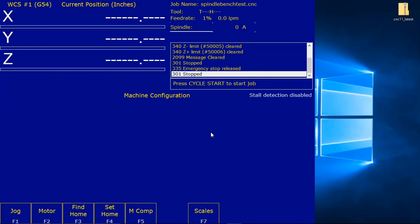Let's configure drive bus assignment. The CNC 11 software needs to be configured to know where each axis of the all-in-one DC is. The all-in-one DC is using something called drive bus to communicate with the CNC 11 software. For a 3-axis mill, all-in-one DC axis 1, labeled axis 1 on the all-in-one DC drive cover, should be configured as drive bus channel 1. All-in-one DC axis 2 should be configured as drive bus channel 2.